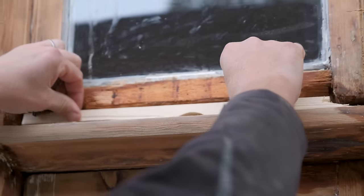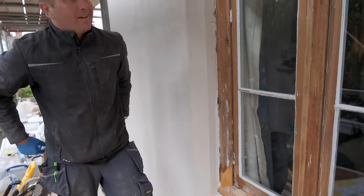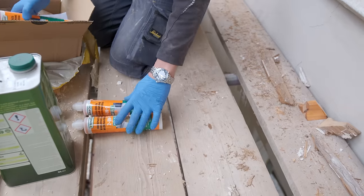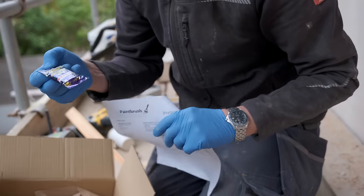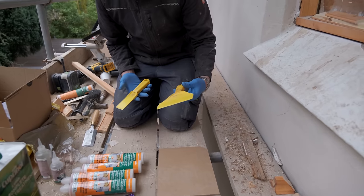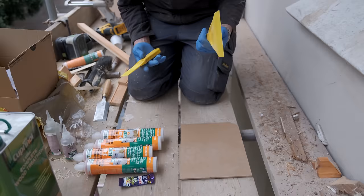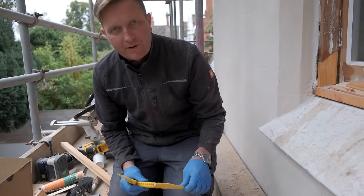There we go — I've got everything that I need. All the resins here, everything's been treated. I've got a few other windows to do. These scrapers are made by the Repair Care company, and it's good because the stuff doesn't stick to it — quite flexible, which is what you need when you're trying to finish this stuff. I buy the four-hour for quite a few reasons. The first — the one-hour — is just really for small areas. I don't really like the one-hour that much, it's not as pliable and obviously you haven't got the working time.